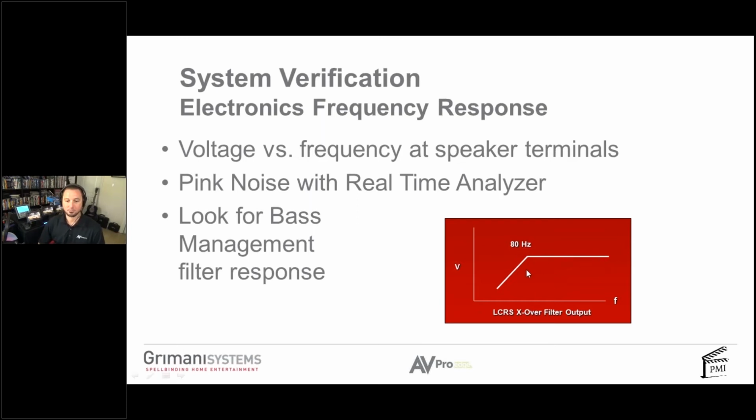The other thing that could happen, and I'm about to talk about that, is that the speaker wire is too thin and too long. So some of you are asked sort of about this. If you have 100 feet of 16 gauge wire between your surround decoder and a speaker that has a stated impedance of 4 ohms, you're going to see an error in the frequency response over here. And that error is going to follow the impedance curve of the speaker. You will see it in this measurement.